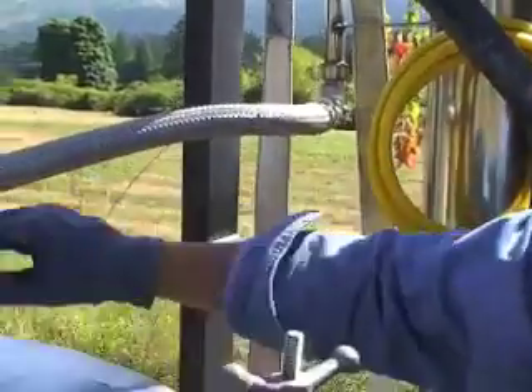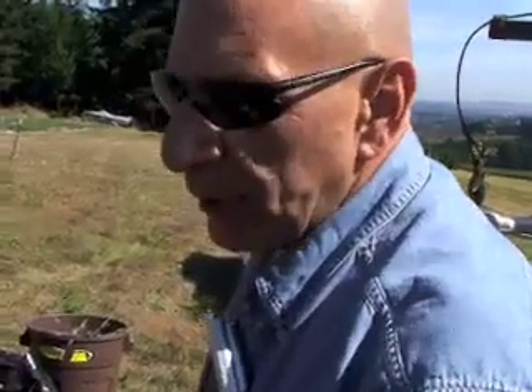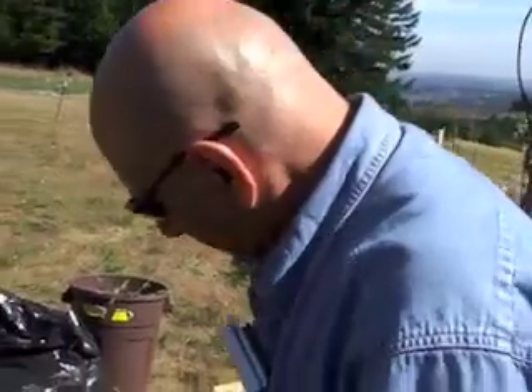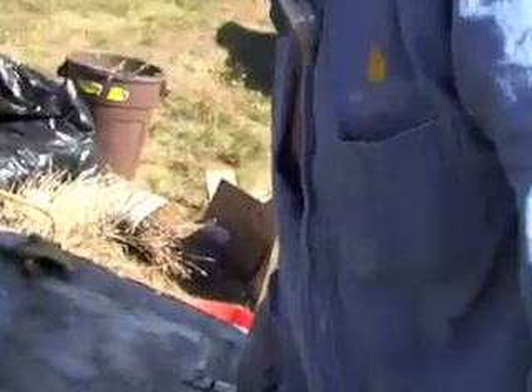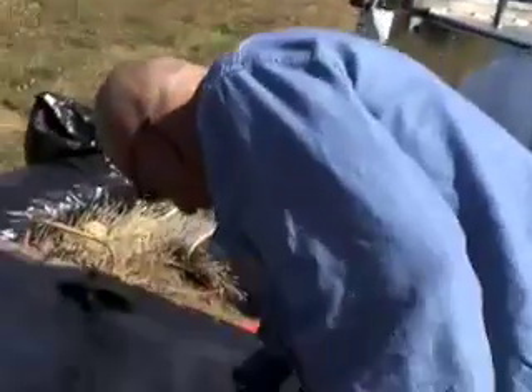It's easy to put together, very simple. Now I'm going to turn the steam on. I'm going to open this valve here and allow the steam to come in. It's going to have a little bit of water in it. The retort is cold, and that's going to condense more steam coming in. So there'll be a bunch of water I don't want to fill this up with, and I don't want it to cover my steam spreaders, which is where the steam's coming in. So I'll leave this open a little bit and let it drain while I'm heating it up.